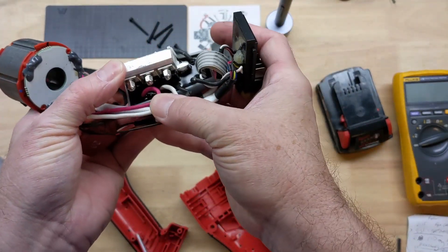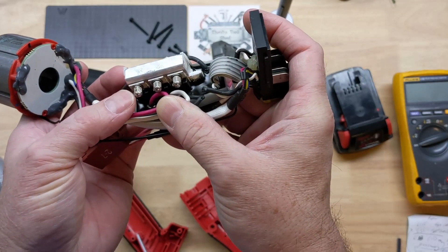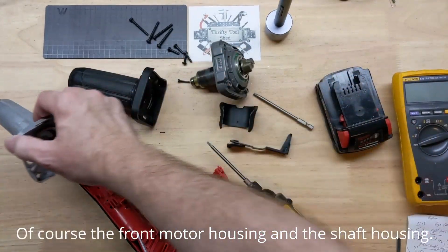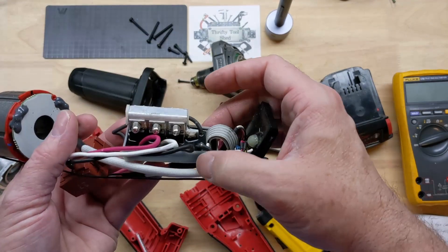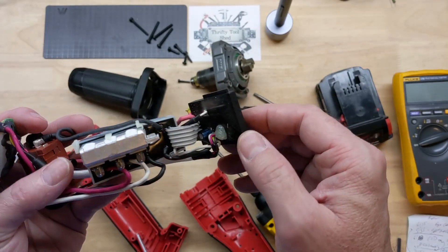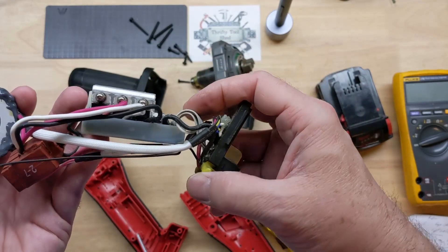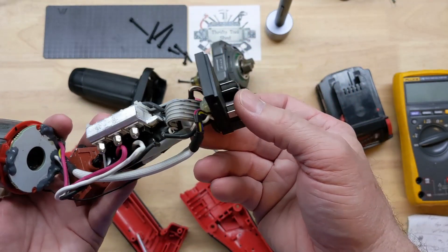Look at those MOSFETs. That might be the first time I've ever seen Acorn nuts used to fasten down MOSFETs to a heat sink. The negative was just run up to make a good connection with the metal housing of the die grinder, the shaft of it. Definitely a potted speed control. Even your battery connectors are difficult to work on — a lot of silicone potting and ribbon cables. Two ribbon cables coming out of your connector — just great.